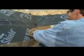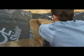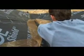To install Z-Mesh in a valley, make a 90-degree fold and run the Z-Mesh up the valley, keeping it one inch away from the center. Temporarily tack the Z-Mesh in place until the entire zone is laid out. To make a parallel run on the other side of the valley, make two 90-degree folds and install the Z-Mesh as before, keeping it one inch from the center of the valley. Remember, Z-Mesh cannot be installed under valley metal or metal roofing material.